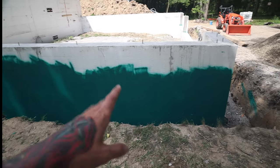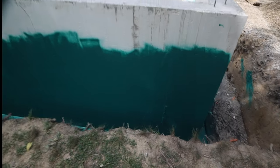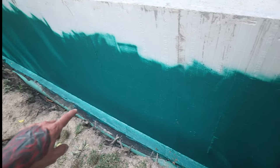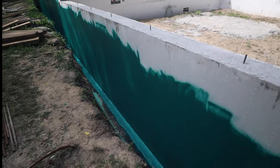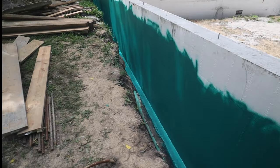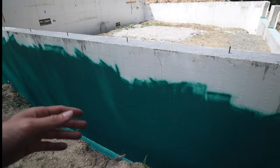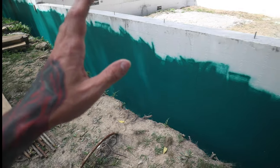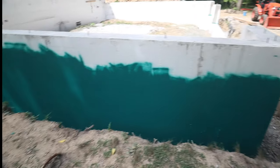went and found any crack or crevice that I didn't like down where there's seams or blocks come together and down around the foundation. And I went all the way around it with a paintbrush and went ahead and filled those in. Rubber wall does say that you can apply this product with either a spray gun like I did. You can also paint it and you can also roll it on. So there's many different applications that you can use.